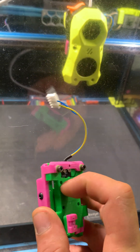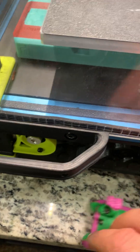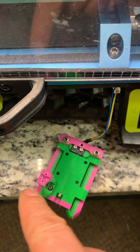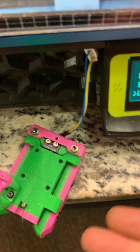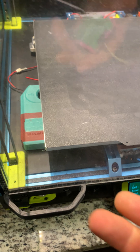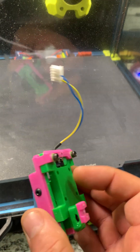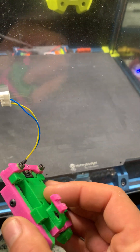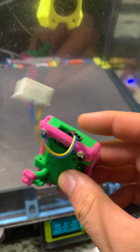There's not really anything that can be done about the cracking because of the layer lines. When you print it, it prints standing up so the layer lines run in a direction that's vulnerable to splitting. You'd want the layer lines going the other way, but because of the shape of the body and the offset between pieces, you can't orient it differently. If you flip it, the flexors will crack, so it has to be printed standing up.